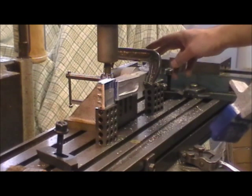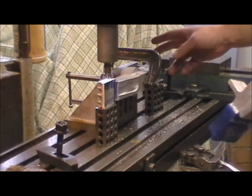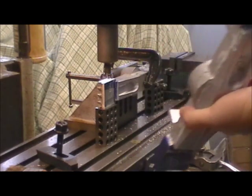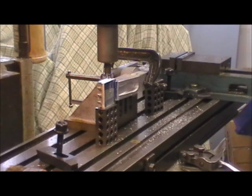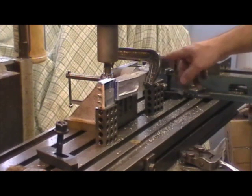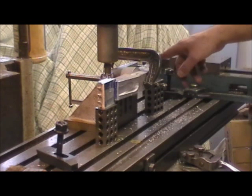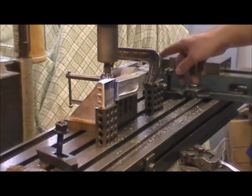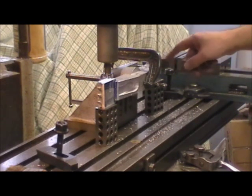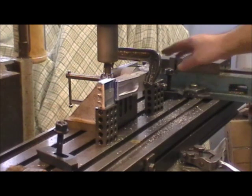So I come over to here — four and three-eighths — plus the cutter — and so we're going to find the center. The cutter I'm using is a T-slot cutter I had, and it's close to an inch but not quite. So what I'm doing is going on center of that — it's about thirty thousandths short. So I just take fifteen off each way: move the table one way fifteen, the other way fifteen, and clean up the slot — gives me a nice cut. It's an inch plus, I think, five thousandths for a little bit of play.